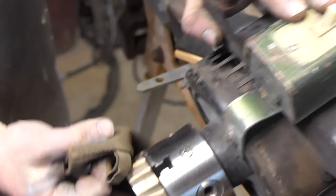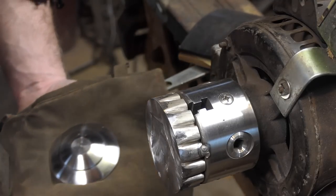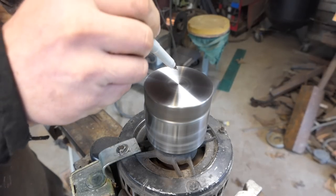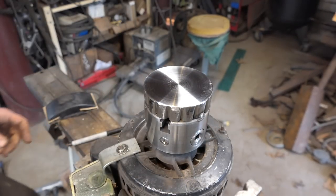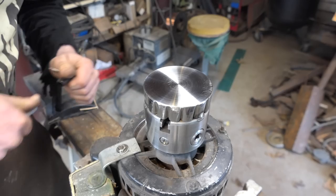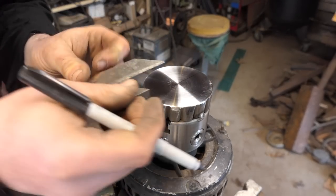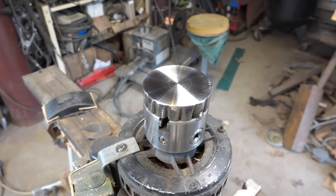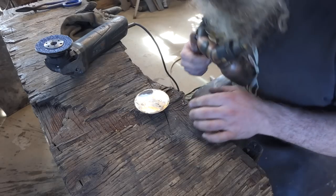That was a lot of work to free this guy. I was kind of curious how off-centered this thing is. You can see that black dot is the spot it's spinning around, and I don't know how badly it would have to be off for me to detect it with sharpie technology. It is off-centered — it's detectable via sharpie. See the difference between the rectangle created by the lines and the actual little center dot? That is quite a bit. I'm actually surprised given how off-centered it is, how even-looking the result came out. Because of the shape of this I can't get a good grip with gloves on, so I have to do this freehand — I'm just taking down the back of this. It doesn't actually matter if the back is scooped out a little bit; it's just the edge that has to be flat so it goes nice and flush.